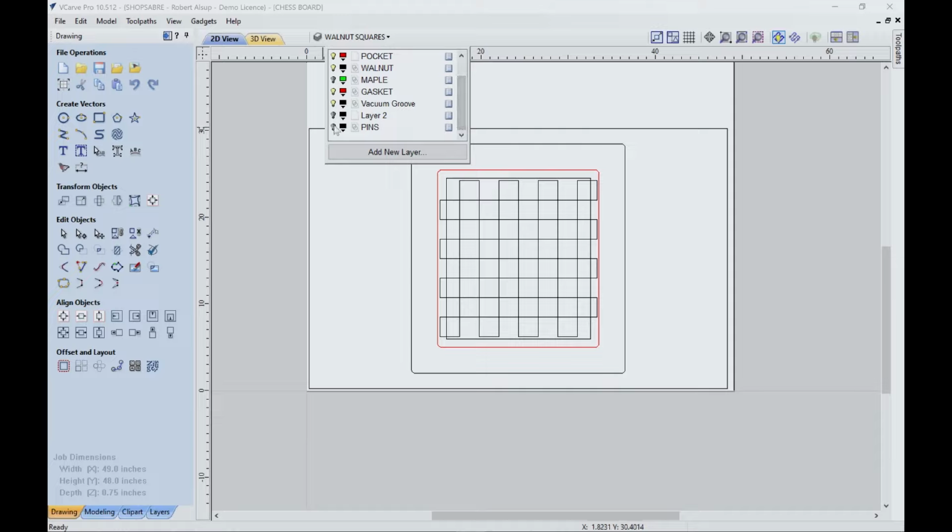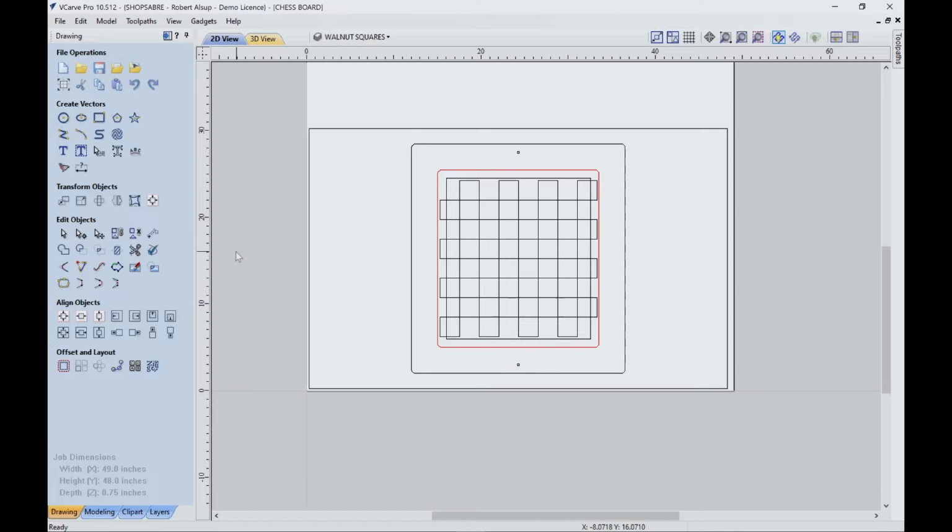I believe that's these pins right here. So you got a pin here and here. And that allows us to take a piece off, turn it upside down, and have it indexed correctly so the front side and the back side line up. So those are the kinds of things that are involved here. So the first thing we would probably do then is to machine this fixture board and get that set up.